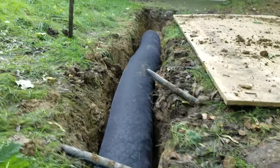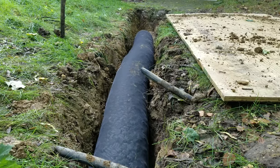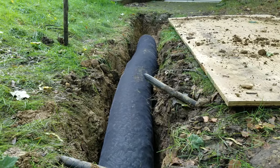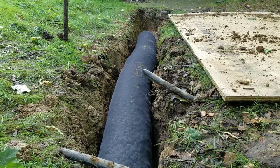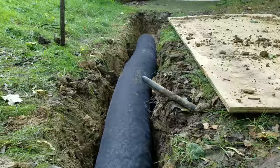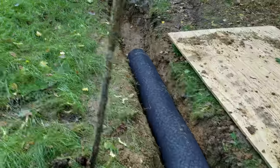When I dump stone into my drains, it pours to the shape of whatever I dug out — around a three-foot boulder, an old stump, whatever. This trench was dug with an excavator, so it's square; with a shovel it would have been more rounded. That's why this easy drain system is really ideal for a homeowner or a contractor that's not very well equipped.